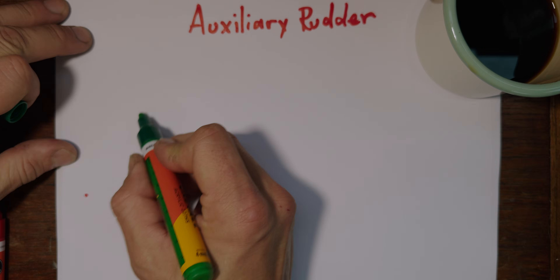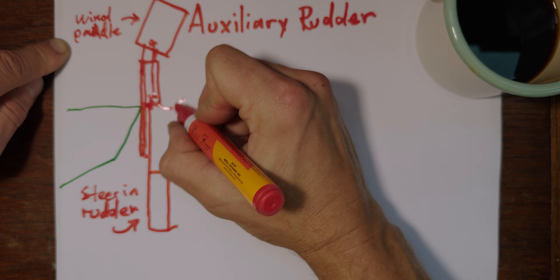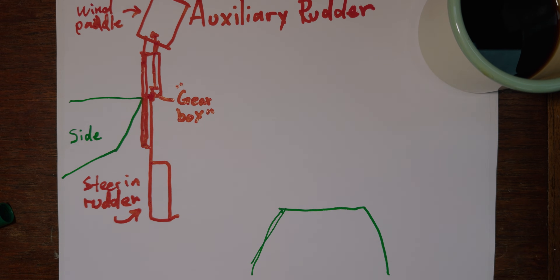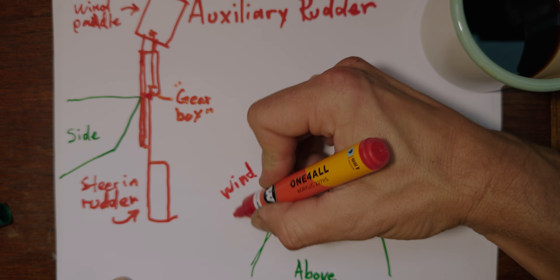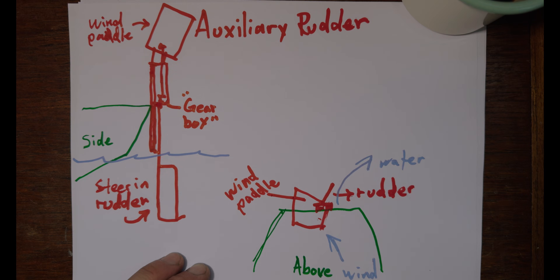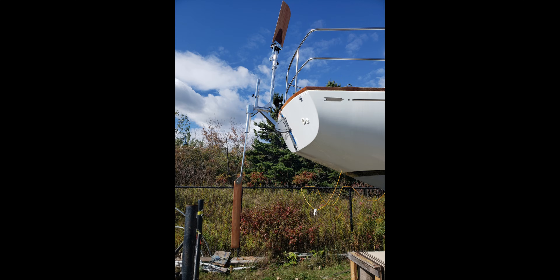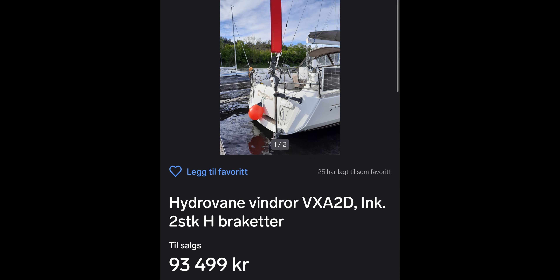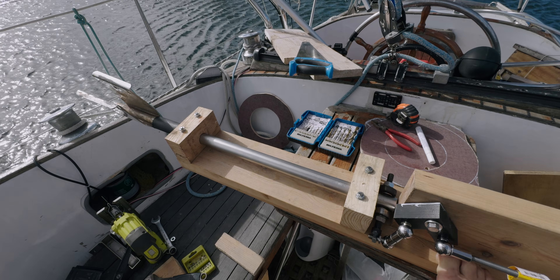Three, auxiliary rudder. In this design, you need a bigger wind paddle that directly steers a rudder that is not connected to your big rudder in any way. The pros are that you don't need as many joints and lines as the pendulum type. Another big pro is that it works as an emergency rudder — if you get attacked by orcas, you have another rudder to steer you to port. I don't know if they work as well in very little wind, but I will try that out. These wind vanes are usually very expensive, 2,000 US dollars plus. The Hydrovane is 9,000 US dollars in Scandinavia. That's a lot of money. I don't have that kind of money, but I want to try to build one myself.